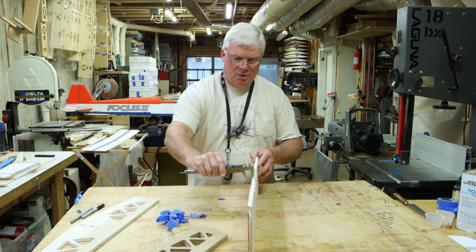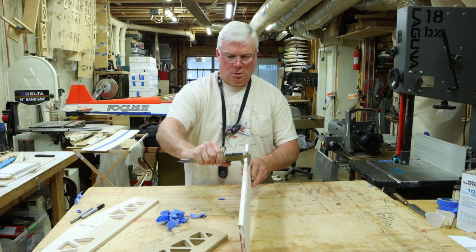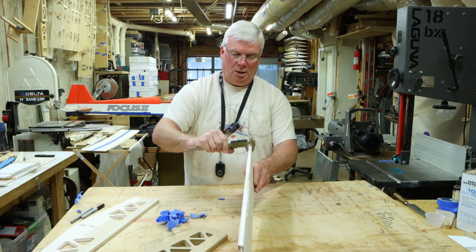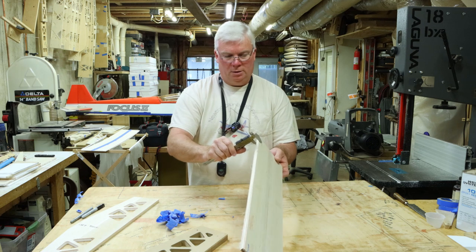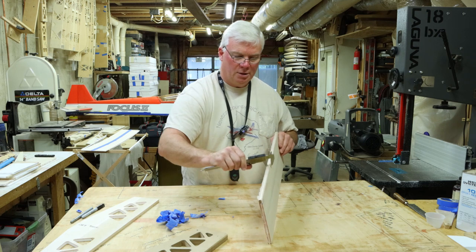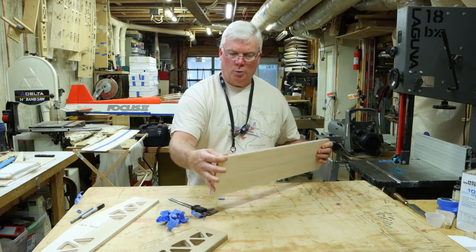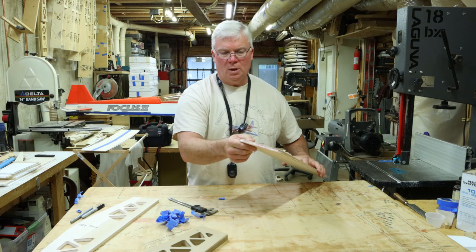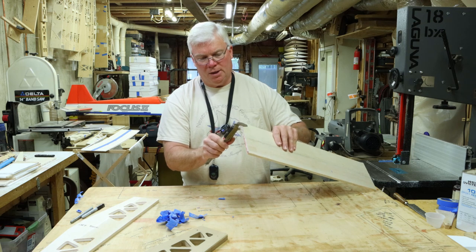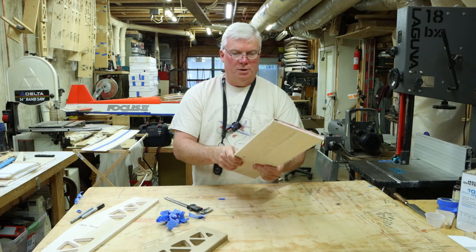So 10.87, 10.92, 10.94, 10.98-ish. So that is 10.86. This is the back side, of course. It's going to be standard all the way across. So that's nice. Turns out we're just a tad wider on the front than we are in the back. So maybe our spacers didn't need to be quite that thick. We could have gone down another couple of thousandths with them, but that's pretty darn close now, because remember, we're talking a tenth of a millimeter, which is awfully small.